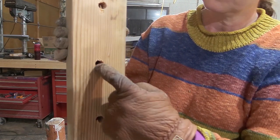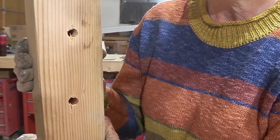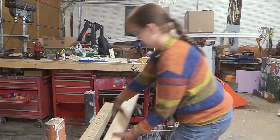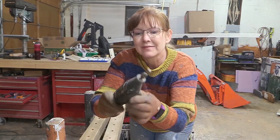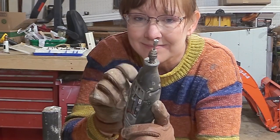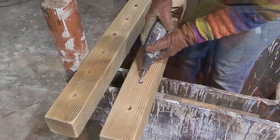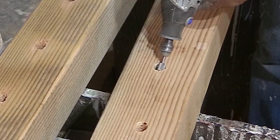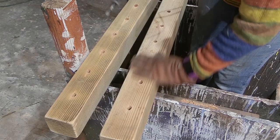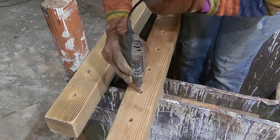You can see there are still some little splintered pieces of wood around the edges of the holes. One way to fix that is to use a Dremel tool. You don't have to do this, but it really makes the jump standard look professional and just perfect. I've got a Dremel so I figured I might as well use it. I just run the Dremel around each of the holes I drilled — it really helps to give it a more polished and clean appearance. I take a few extra minutes and make sure it's as perfect as it can be.